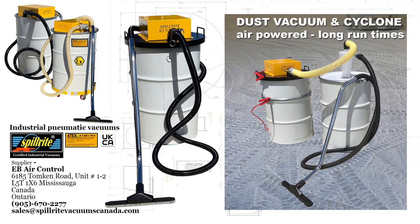The system can be coupled with a cyclone, and when it is coupled with a cyclone this enables the unit to run for long times without having to replace or clean the filter. The cyclonic separator has an efficiency of between 95 and 97% and is very effective for all sorts of dusts.